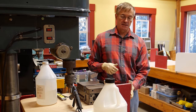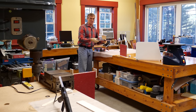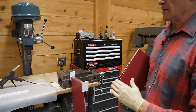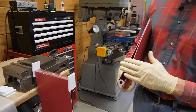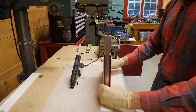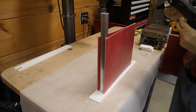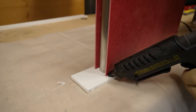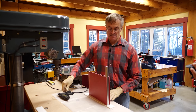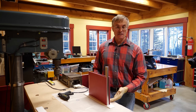I'm going to show you how I filled these up very quickly by using the same sort of epoxy technique. This has had about 30 minutes now to tack up — it's not going to be very strong, but it's strong enough for our purposes. In order to frame this part and get this closed in, I'm going to set this down on a longer piece of PVC to form a barrier on the bottom surface. Then, using the trusty old hot glue gun, I'll run a bead along here. Give this about two minutes and then this is all ready to receive a dose of epoxy.